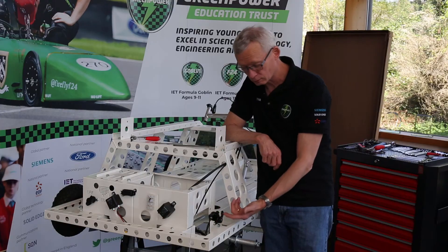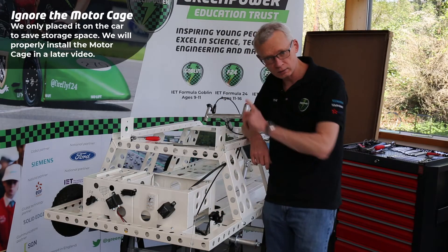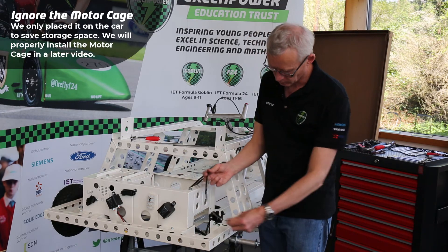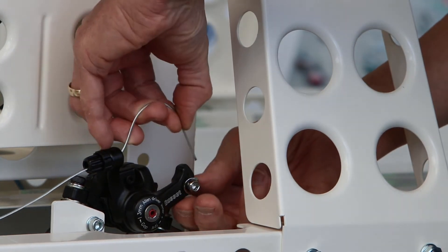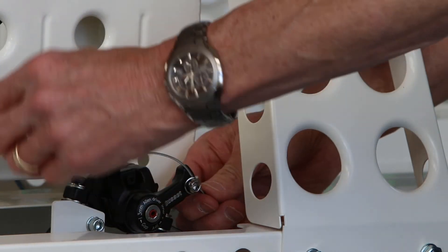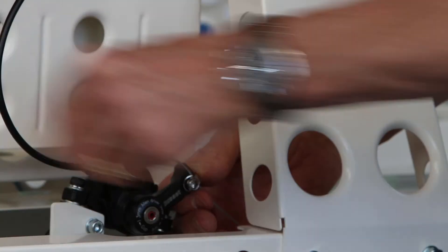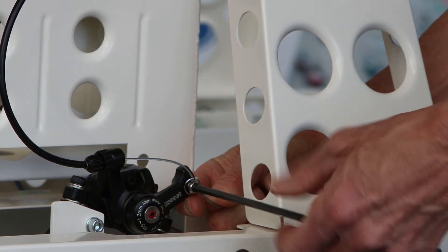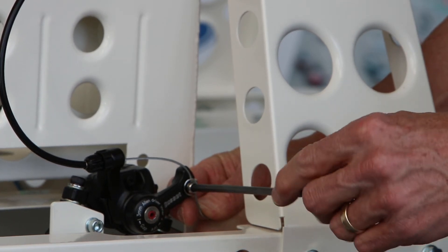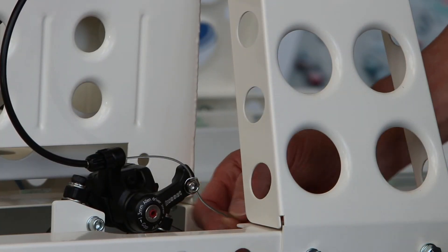It's quite impressive what skills can transfer into everyday life. To allow proper adjustment of the brakes later, screw the adjuster in as far as it will go — both here on the caliper itself and on the brake lever at the front of the car. I can take my cable end, feed it through here and down through the clamp on the actuator arm. We're looking for a nice smooth curve here; if that curve is too tight, it'll restrict the movement of the cable through the outer. Make sure the cable is pulled down tight from the other end, then nip up that clamp. There's a little groove in the clamp for the cable to go through — take note that it goes through that correct slot. Later on we'll also cut the end off so we haven't got this tail lying around.